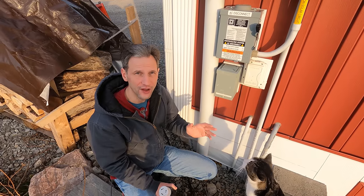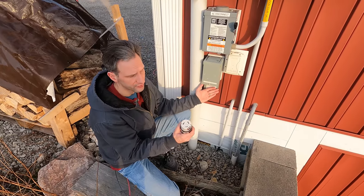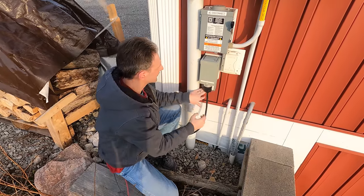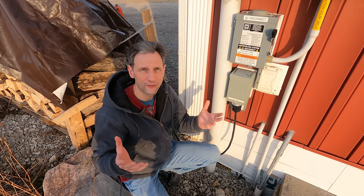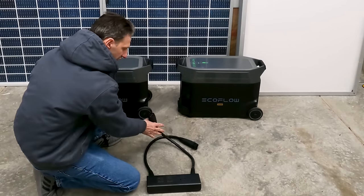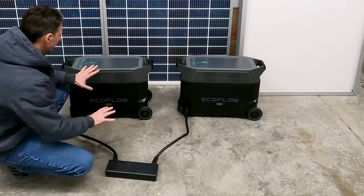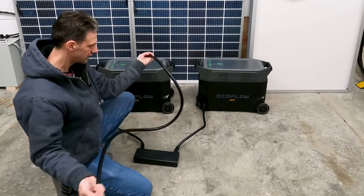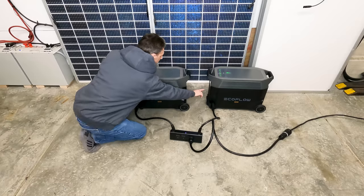If your house is already set up for a generator, you'll have a plug to connect your generator to. They can be different amperages so you have to make sure your plug matches. In my case I have a higher amperage plug, and I'll put some information on the types in the description. I can simply plug it in, give it a quarter turn, and now we're connected to the building. All I have to do is connect the other end to our EcoFlow hub, then flip the transfer switch and we'll have power to all of our emergency circuits. With the units in position, I just need to attach the double voltage hub. It has a very nice sturdy plug, but the orientation of the plugs is pretty inconvenient. Then with just the standard 30 amp twist lock plug, you can plug it in and connect the other end to the generator extension cord, which has a 30 amp plug on one end and a 50 amp plug on the other. Alright, it's plugged in — let's power it up.